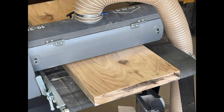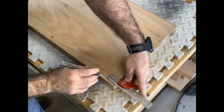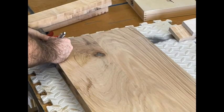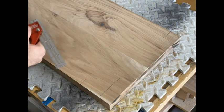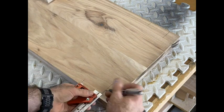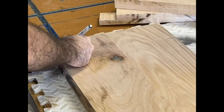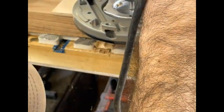After the final dimensioning, you see me running it through the sander. Then I'm marking out where the legs are going to go — as I mentioned, this is going to be recessed into the edge. But what I and my wife liked was having the legs stick out just about a quarter of an inch. So you see me marking it out, pre-drilling some holes, and using the router to help hog out some of this material.